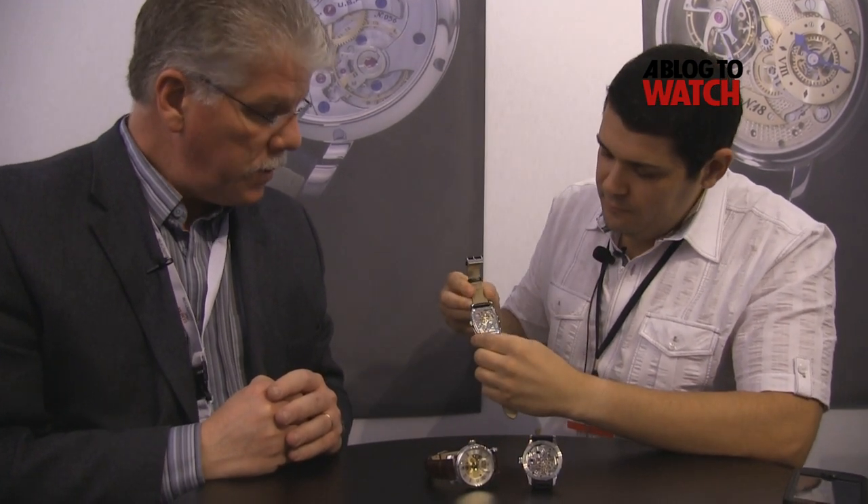It's a very unique movement. One of the most unique things is the motor barrel, which was something used in the very high-grade American railroad watches — that's for the mainspring barrel. Basically what it does, it takes the typical barrel where you'd have an arbor inside that would wind the spring. Usually it's just one piece, but this arbor is in two pieces. Part of it is fixed to the barrel and it's pivoted in jewels, so it runs very much like a wheel. That reduces friction, reduces wear, and the barrel is more stable — it's going to stay upright.